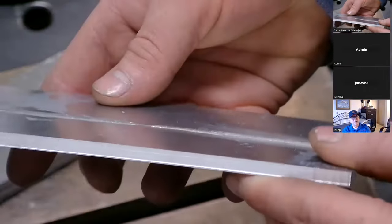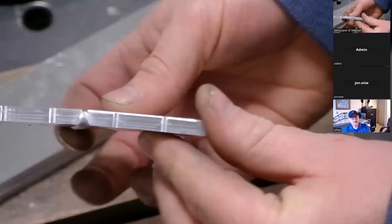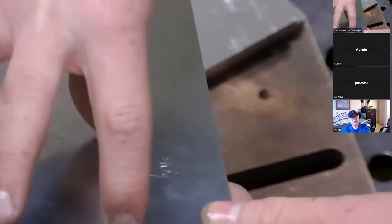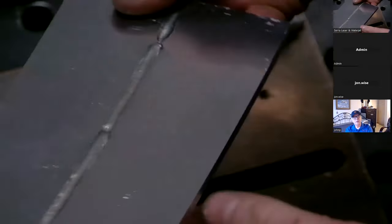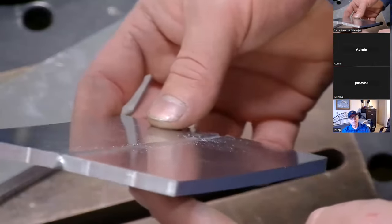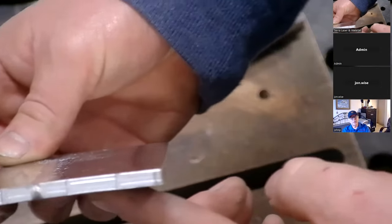That's amazing. No gap, no bevel, no gap. You can see the distortion — there's a little bit of bowing, although I did weld this section twice. This end section has weld on both sides. You see it's minimal distortion, and that's a whole lot of energy that we're putting into that piece of metal.